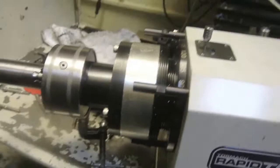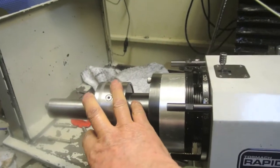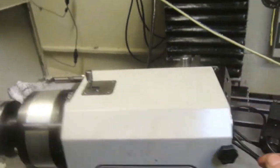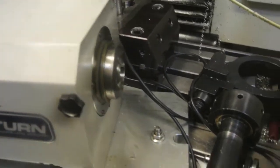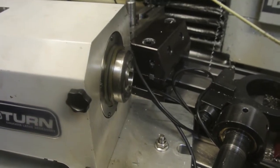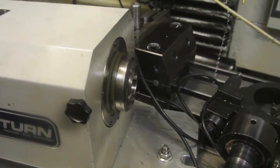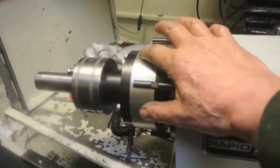After a session of screw cutting I finally got the draw tube for the collet closer to fit the collets. It took quite a bit of screw cutting and I had to be careful. The collets tolerance-wise I don't think are very good — I took one out of the box I'd never used before and it wouldn't go anywhere near it, then I took another one from the same batch, took it out of the wrapping paper, tried it and it was perfect. Generally speaking though, not a difficult job, so I made the spacer.